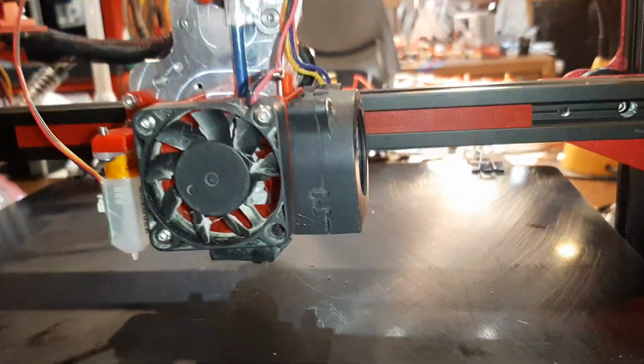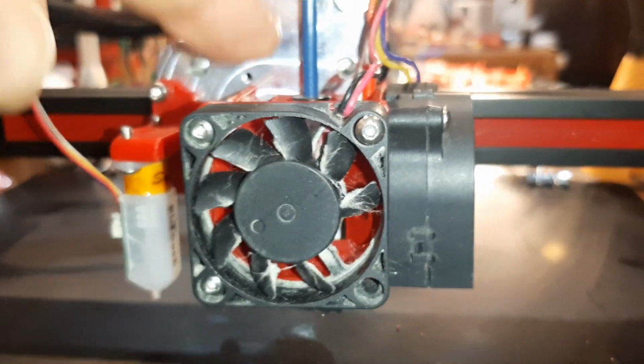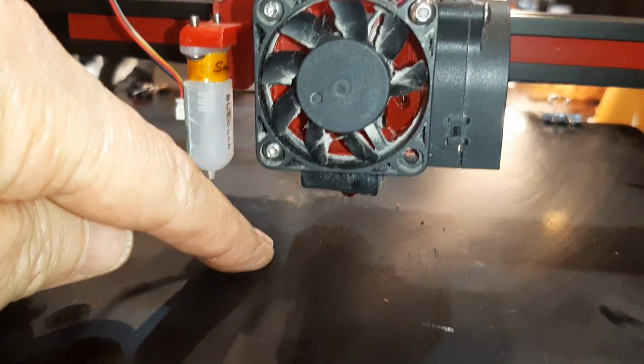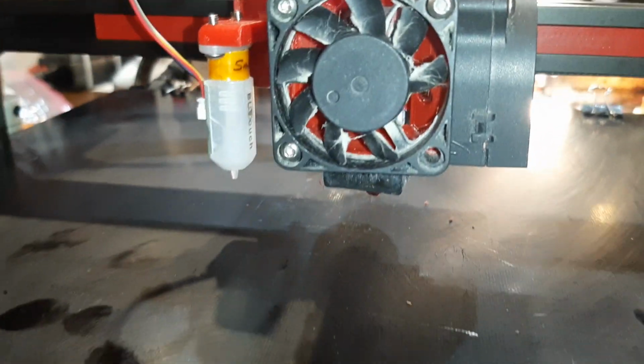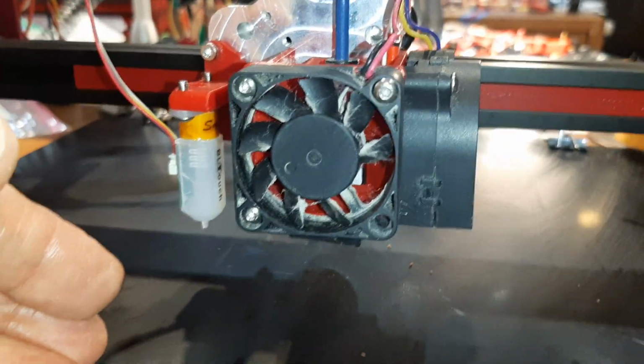You don't want it going up. So he cools the fan right before the filament, right before it gets to the heater. These two fans cool the part that's down on the plate as you draw it out. I had only one fan, so all the cool air was coming from one direction, and I was getting sagging filament on the left side.